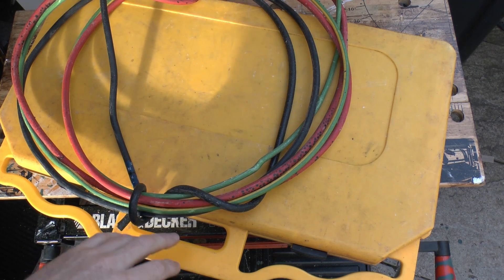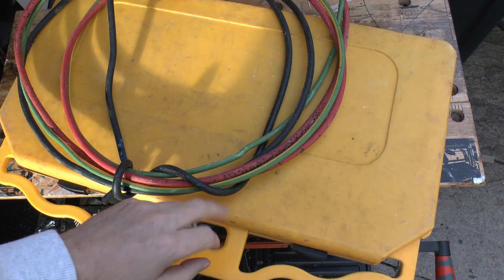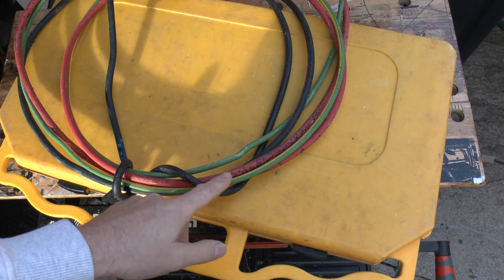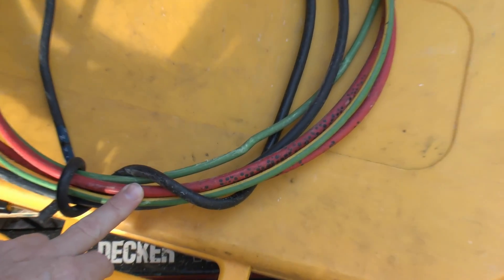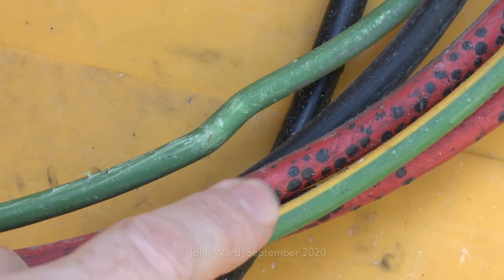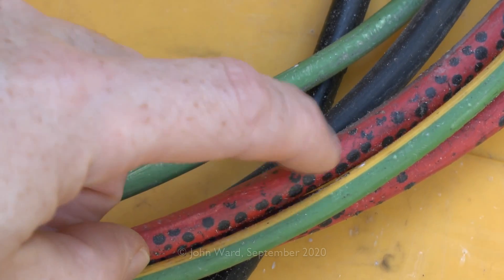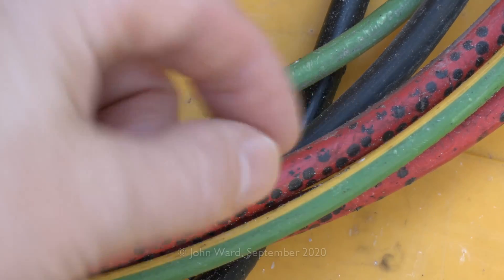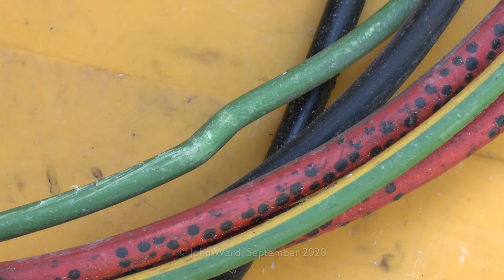This is the cable from that installation after it's been pulled out of the cavity. It's not terribly damaged but we can see on this red piece here various black spots where the beads of polystyrene have reacted with the outer covering of the cable. You can see it on the outside covering — this isn't particularly badly damaged but it does scratch off, and each one of those black spots is where one of those expanded polystyrene beads has started to degrade the insulation.